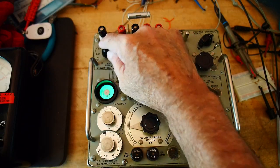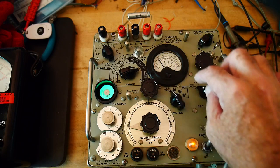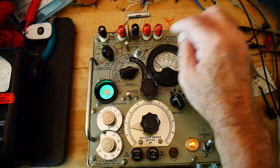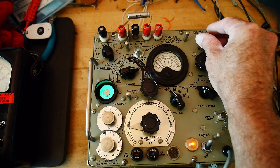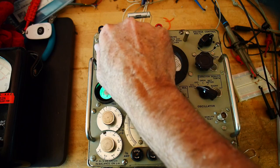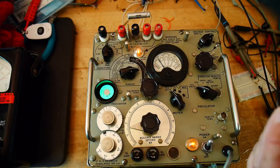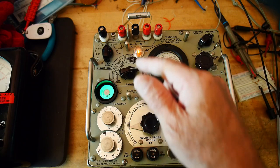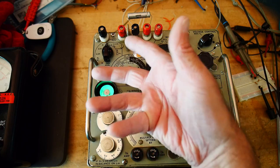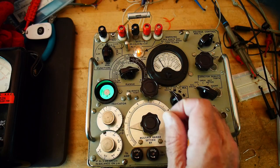So that was on the non-charged position. Now we can test this thing at voltage, by looking at this meter. I put this on DC volts, and I can adjust the voltage I want on that capacitor before connecting it. I'm going to put 100 volts on that — adjusting right up to 100. Now it's measuring 100 volts, and this light lights up saying danger, don't touch over here. Now it's putting 100 volts on that capacitor. I can go back and adjust the eye again — it looked the same as before. It's still 26µF.